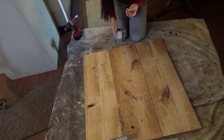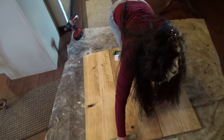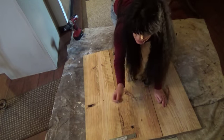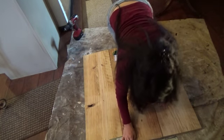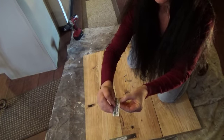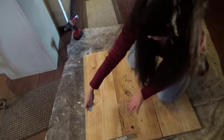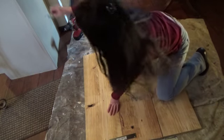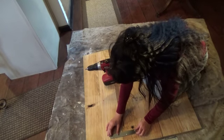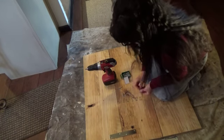Make sure your screws are not going to poke through to the other side. This is supposed to be two inches but I measured it and it's really one and a half inches. So I got these screws which are one and one-fourth inch. This board clearly says two by twelve by ten — it's definitely 10 feet and 12 inches wide, but only an inch and a half thick. I don't know how they get the 'two.' I'm just going to drive in a screw for stability.